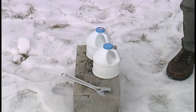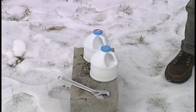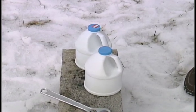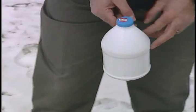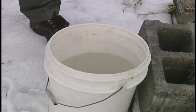The product that we're going to use is a standard 5% bleach. You want to make sure you don't get anything that has dyes or any scents to it — just regular old bleach. We're going to use about a gallon, which for most wells will be plenty. We're going to take the bleach and mix it with a couple gallons of water. You don't want to put the straight bleach down because it's too corrosive and it might start to eat away some of the metal on the casing.